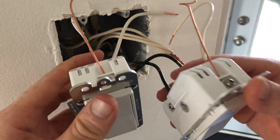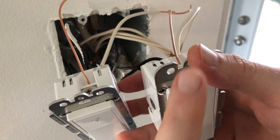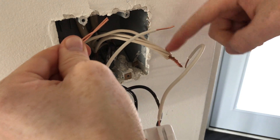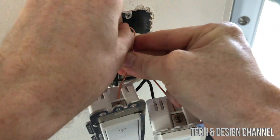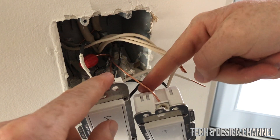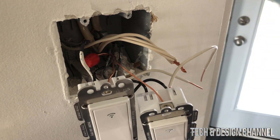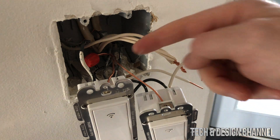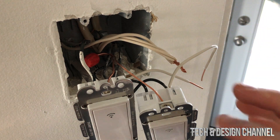Make sure as you're doing this that the switch is oriented upwards — it looks nicer if the Wi-Fi indicator faces up. Put the ground together first since it's all the way in the back, then the white cable. I hooked the ground up back there with the rest of the ground — it was a bit difficult since I couldn't move the camera in there. Make sure it's really tight. Before closing everything up, I'm going to test that it's actually working. I don't want to close it and then find out I have to take everything back out. Sometimes connections get loose when you push things in, so test before putting the plate on.